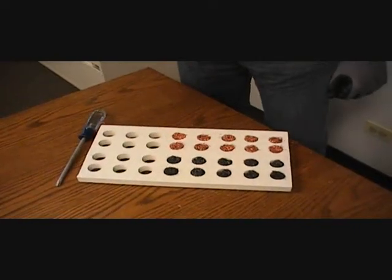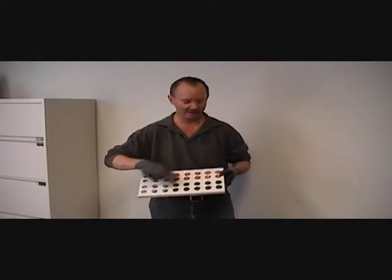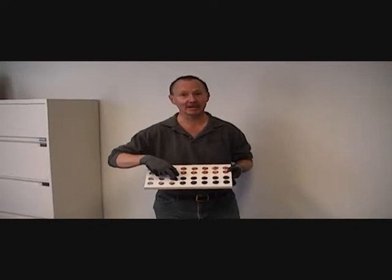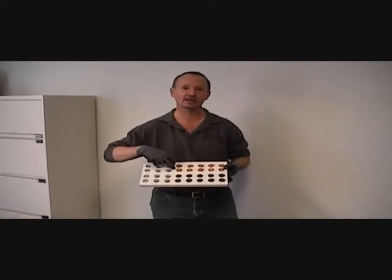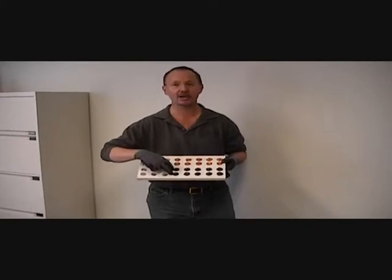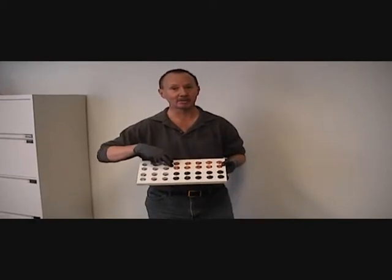Done. It took about 4 minutes and 5 seconds to fill 10 holes using copper mesh. Okay, we just filled 20 holes, 10 with Xcluder Fill Fabric and 10 with copper mesh. Now the 10 with Xcluder Fill Fabric took about 90 seconds, about 4 minutes and 5 seconds for the copper mesh. So that's an almost 3-to-1 ratio. It's 3 times faster to use Xcluder than it is copper mesh.